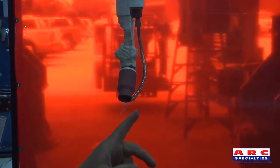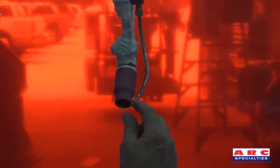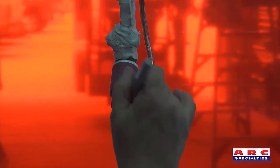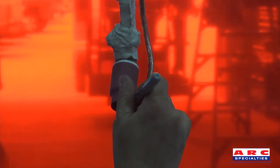The end of the wire guide should always be in the same place. Part of what affects how many amps are needed for the hot wire is the distance from the wire guide to the tungsten. So if needed, mark the spot where the wire guide lines up even to the end of the cup and cut it off using a band saw. This way the amperage is always the same for the hot wire.